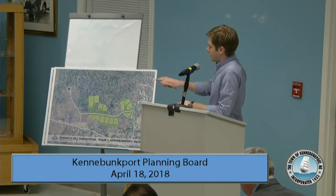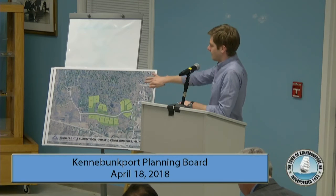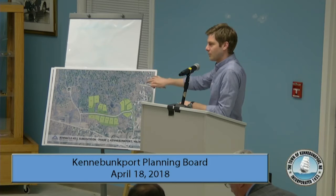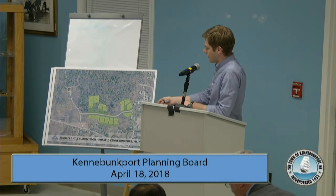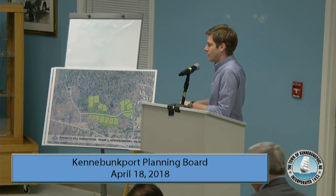And I'll say phase one was designed in a similar way. I think every lot in phase one has a grinder pump and a force main. I was going to say, if I'm not mistaken, it comes down to Bitterford Road. Comes down to Bitterford Road, forced in, exactly. It does that way, yep. Right. We've submitted an application to the sewer department, and we're responding to comments as they've come in.